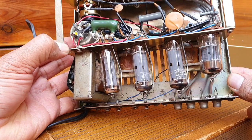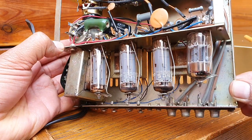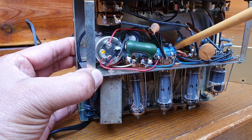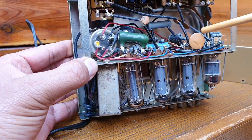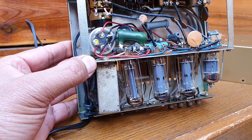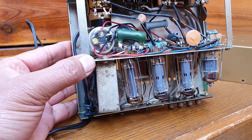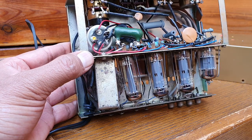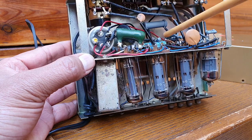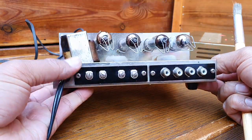It's a 40 microfarad, 150-volt rated capacitor. We have a couple here. These are resistors. The other capacitors — PF types — don't go bad as early because they are not electrolytic. But if somebody wanted to do the project, it's easy to replace all of them. Resistors cannot go bad so often, so I think the poor sound filtration is mostly caused by the dried electrolytic capacitors. If these are replaced with new ones, the sound quality will increase by more than 100%.